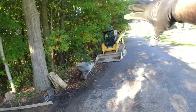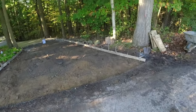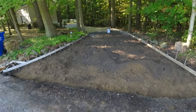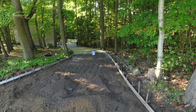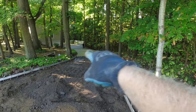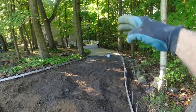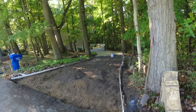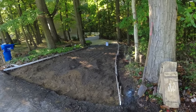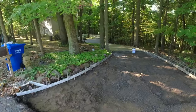Okay, on this bend, we wanted a nice wide approach. Now they can swing in here real fast. 18 feet across down to right where the bucket is. That's 10 foot wide, just over 10, to 12. We had to skinny it up to get around those in between the trees. So let's get this graded. You saw concrete coming and be finishing that in minutes.